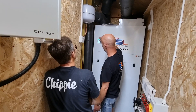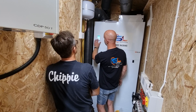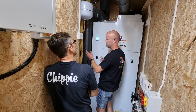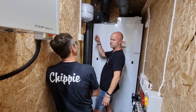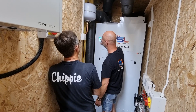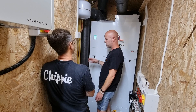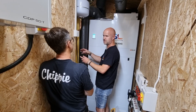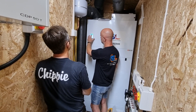Now we've done all the fan speeds, we'll set up how it's going to work — 55 degrees for hot water, legionella cycle set to Monday. Ventilation at low humidity set to level one, because you don't want to run the fan fast at low humidity. Ventilation at high humidity set to level three for 20 minutes — so if you have a steamy shower it'll detect it and run for 20 minutes. You can change that between zero and 60 minutes. The humidity boost kicks in relative to the baseline — if grandma stays and there are more showers, it'll adjust automatically.